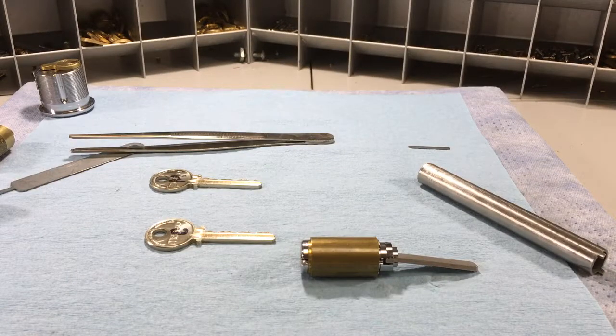That's how you can reassemble the older style 20 series with nothing more than your thumb. No special tools, no special-cut incidental master keys, don't have to remove the cap, don't have to load it with top pins — which can be a real pain for your one and two masters; three, four, and five give you a little grip but it's still no fun. It's a heck of a lot cheaper to do it this way than cutting all those incidental masters.